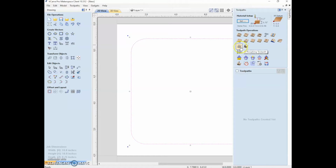So here it points to a few other things you can do, which is roughing and finishing. So roughing, and you may be familiar with this from Fusion, is when you remove the bulk of the material, use the biggest bit possible, and then the finishing pass, you just remove a very little bit of material. You might use a smaller bit and you take much smaller passes. You remove less material. And what that does is it leaves a much smoother, nicer last pass for the surface finish. Here you can have a whole bunch of tool databases, which will be particularly useful when we have the automatic tool changer. But you can also put in your own tool database here. So if you have a bunch of tools, you can put them in so that you know what tools you have to work with. And we'll preview it once we're ready.